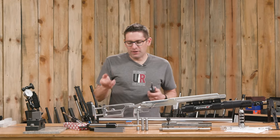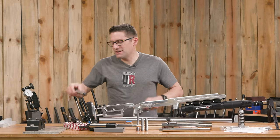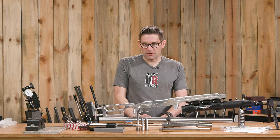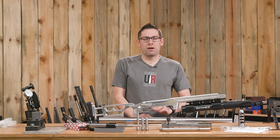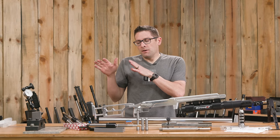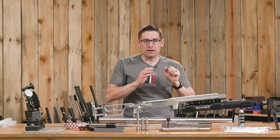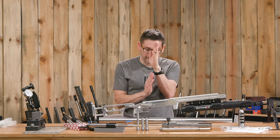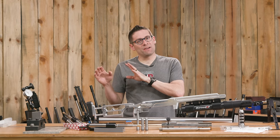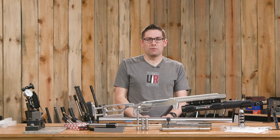I haven't had a problem yet. I've got the 7/16ths, the 12mm, and the 18mm — all working really well. The evidence is in the cut. When you're reaming with a rigid reamer holder, you hear the chips curling inside the reamer flutes. It's a completely different sound than you'd hear with a floating reamer holder, where you hear movement and things working around. It's kind of like reloading — you either allow the cartridge and the die to self-align, like a floating reamer holder, or you hold everything in perfect alignment. I prefer to do the latter when I can, but it's your personal decision when it comes to your lathe tooling.